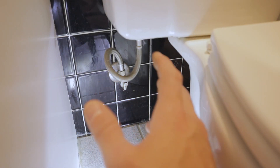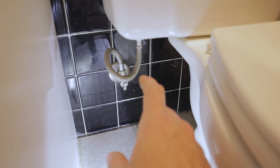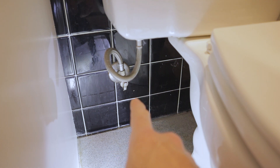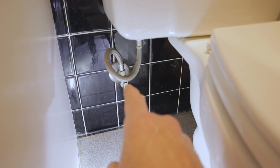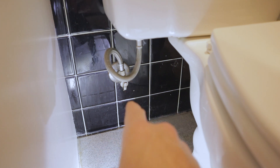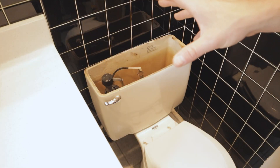One of those things that's just part of an older home - this shutoff valve for whatever reason isn't cooperating. It's just spinning and not tightening down, so the shutoff valve is probably shot. I'm going to have to go downstairs to the basement, find the cold water line that supplies this toilet, shut it off down there, and then we can keep moving.